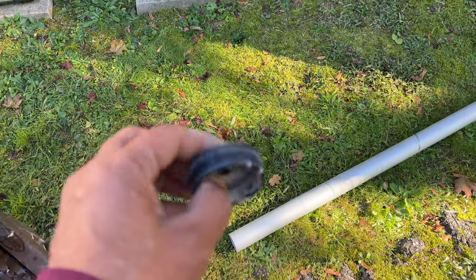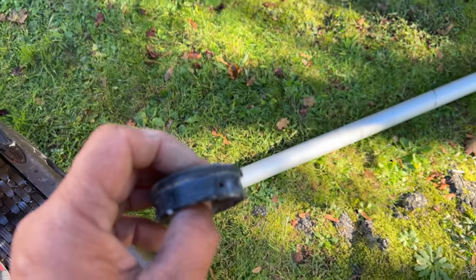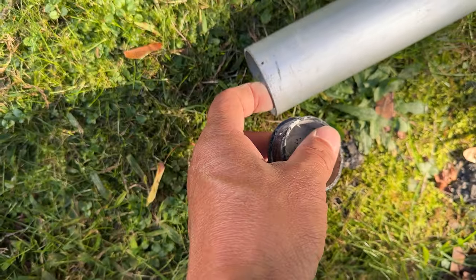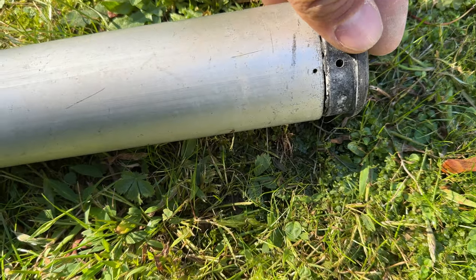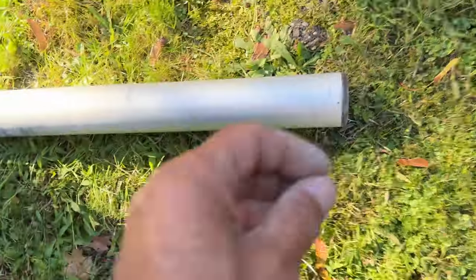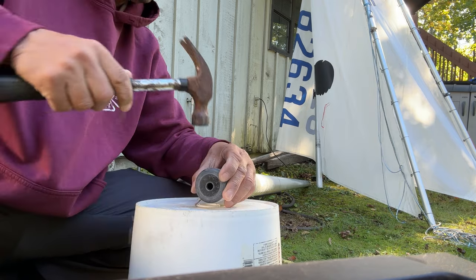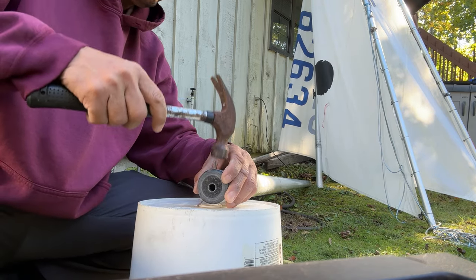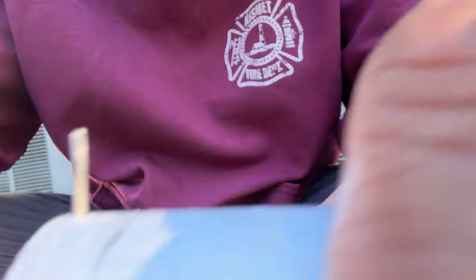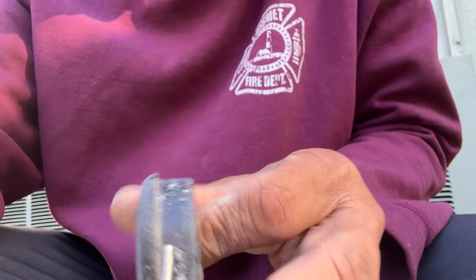This particular mast cap has no hole for the push pin — there's only the rivet hole. So if I want to put a push pin in there I'm going to have to drill holes that coincide with the holes here. Looking at the thickness from the edge, it's not lining up with the rivet hole, and that's why it wasn't going through.